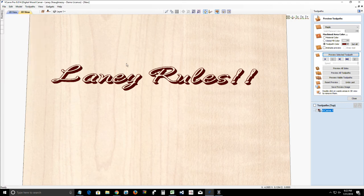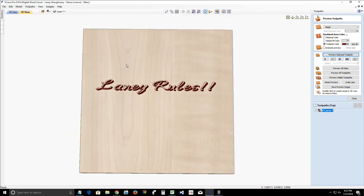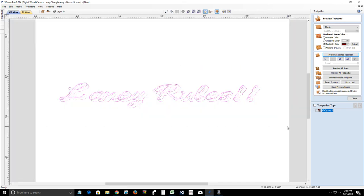Now, the laser engraver is a 6-watt laser engraver, and it is just for engraving. Now, you can cut through materials on small stuff, paper, cardboard multiple passes, you know, thin leather and things you should be able to cut through. But when it comes to the wood, you are wood burning. You are engraving, so you're not going to be cutting out any wood and things. That font name is Bida Bonita. B-D-E Bonita. B-O-N-I-T-A. Very nice font. And we can erase that.